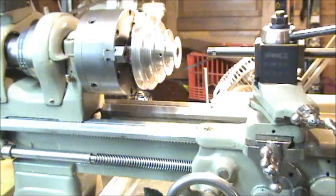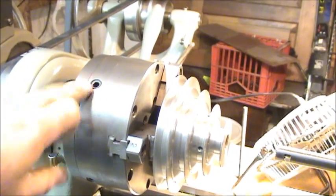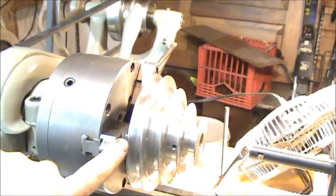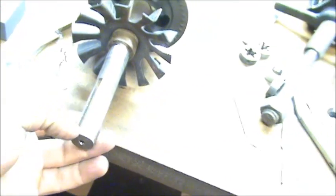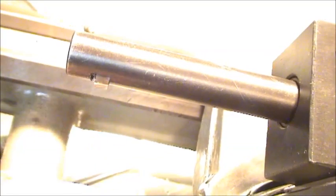It's relatively easy to do, it just takes a little bit to set up. I have the pulley mounted in my chuck — it's just a three jaw, but it has these little holes here, four of them, that let you adjust the back plate to get zero runout. I also have my boring bar set up on my quick change tool post, although this boring bar is a little bit big for this job, but it's the only one I had on hand. The key slot in the motor shaft is 3/16, so I have a 3/16 bit in the bar, with about 10 degrees of relief angle to allow this to be the cutting edge.